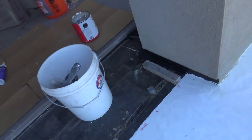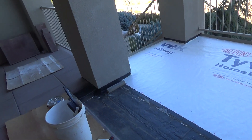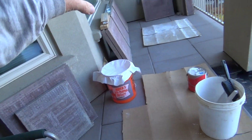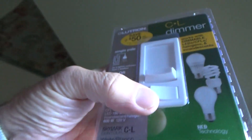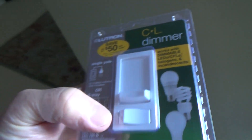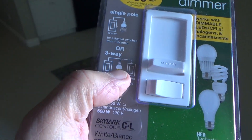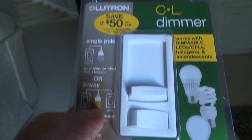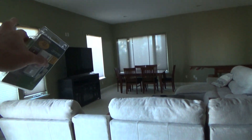Tomorrow I'm ready to reinstall this stuff here. It's a big day — I'm getting ready to reinstall my concrete pavers — but that's not what this video is about. This video is about installing a timer — actually it's a dimmer. You turn it off down here and there's a dimmer paddle right there. The cool thing is it's not just a single pole dimmer; I can hook it up as a single pole or as a three-way. I'm going to install it at the bottom of the stairs.